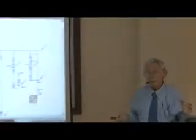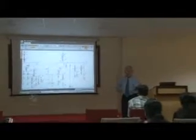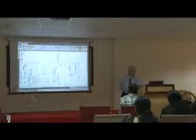Now, is that bus safe to work on? I think so. Are you willing to test it for me and see if it's hot? I don't think so. So you have to go through these things deliberately and say, I'm pretty sure. I know I opened that breaker. I know I've withdrawn it. I know I got the people who are working on it to put their locks on it so it doesn't accidentally get closed again. But there may be an induced charge. I may have made a mistake. It may be wired up wrong. Somebody did something and nobody knew about it, or something failed. Well, things go wrong.